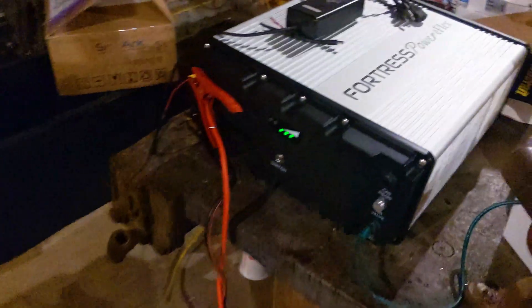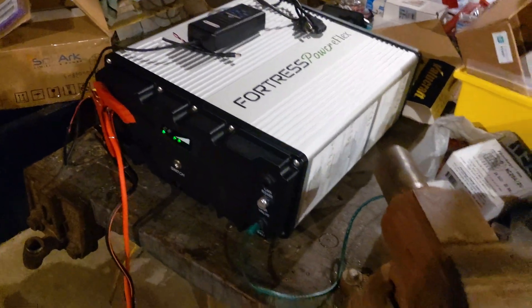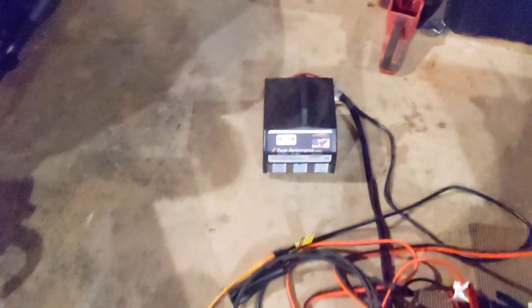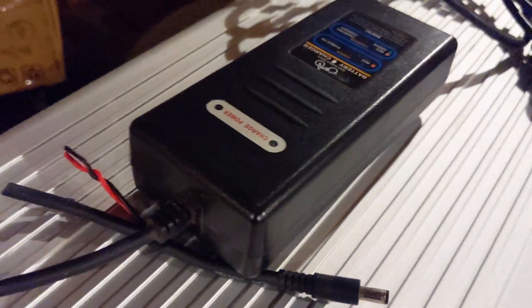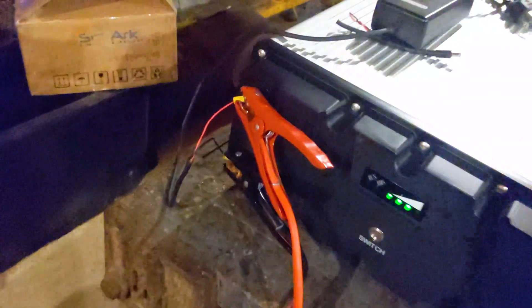This is a rig where a Fortress battery kind of went to zero — not exactly sure why. There were three other batteries and the internet was really bad. Long story short, I got it hooked up with Fortress's help and got the latest firmware installed. I was thankful to have this lithium battery charger for my golf cart. I tried my e-bike chargers just to wake it up. We ended up putting both the lithium e-bike charger and the golf cart charger on it — the golf cart charger has three pins so I was looking for a ground, and it just couldn't reconcile. The e-bike charger got it started and we got the thing charged up to about 60% SOC.